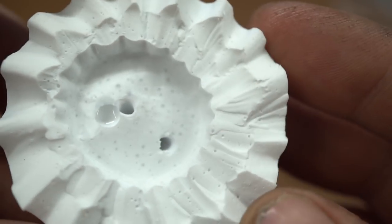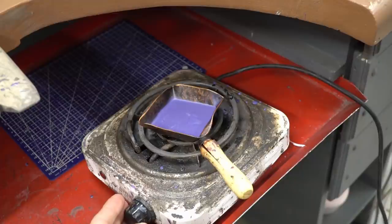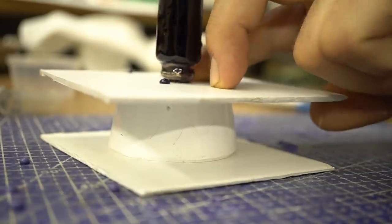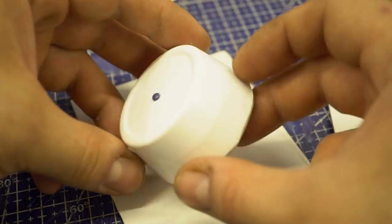Or it came off because it was clamped in the mold. We'll keep that in mind as we cut the mold to have an easier time removing the workpiece from it. On the inside, the teeth make up the upper point of the model, which are filled with wax last, which means that all the air accumulated in the mold is directed towards them, which is why the teeth did not spill over.